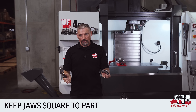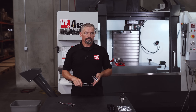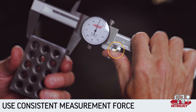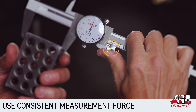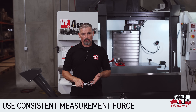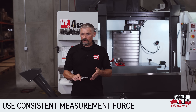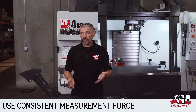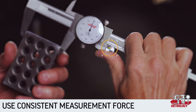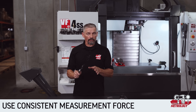If you're just engaging the sharp tips and edges, it's hard to tell if you've got tilt one way or the other. As soon as you introduce an angle, you're changing how far the jaws spread apart and changing the measurement displayed on the tool. When using calipers, think about the amount of force your hand is exerting to ensure you aren't causing the tool to bend slightly and give you a bad reading. If you're trying to measure at the accuracy limit of the tool — about 1 thousandth of an inch — it doesn't take much extra force to make your measurement accuracy questionable.